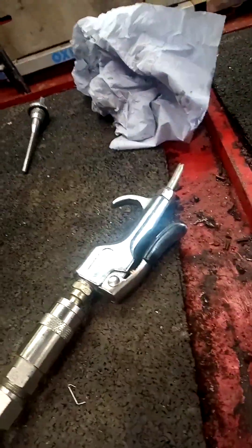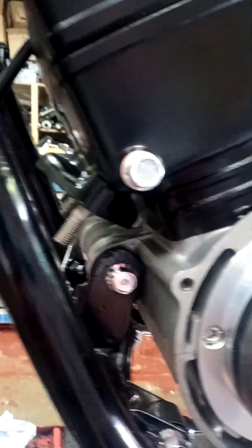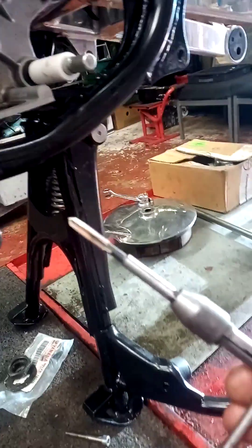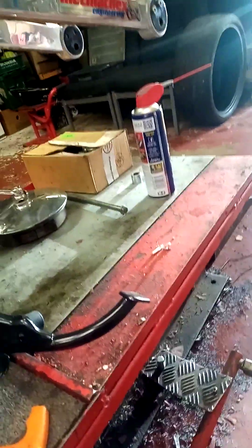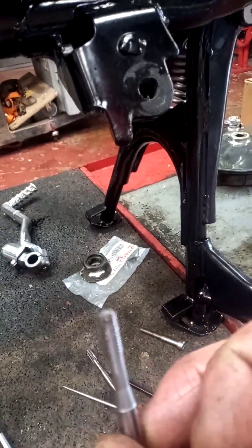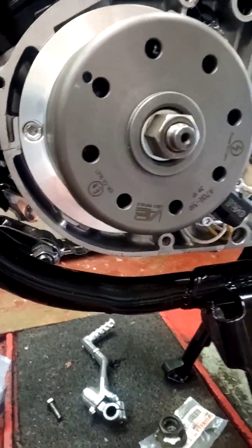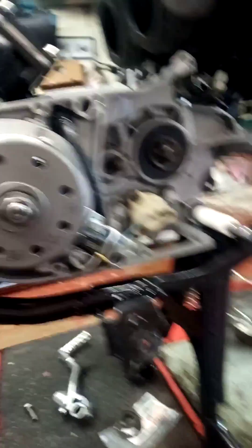What I've got here is my compressor set up and my can of WD-40. So I squirt the WD-40 in, and basically I get my M6 tap - I've got one here on the socket wrench - wind it in, wind it out, then blast out any junk. Apart from the stuff that collects on the tap, it cleans all the threads out.